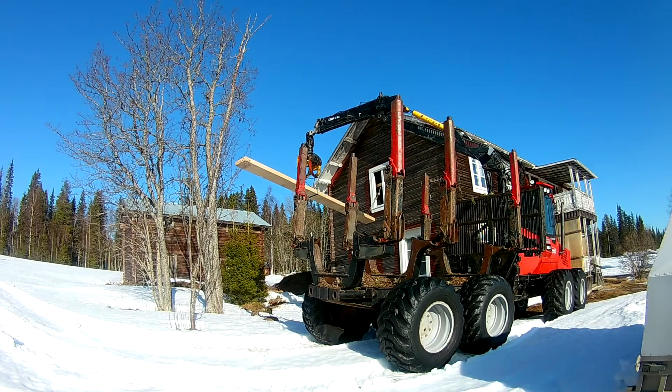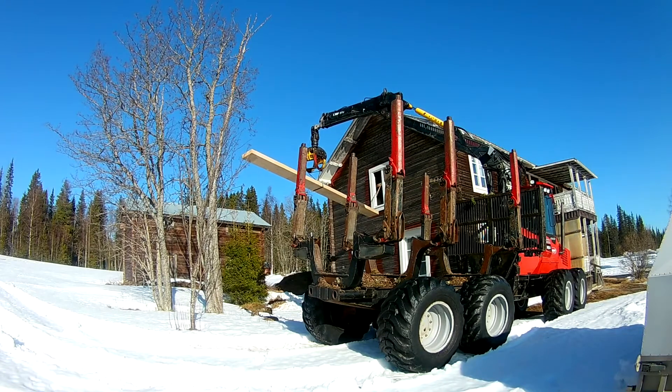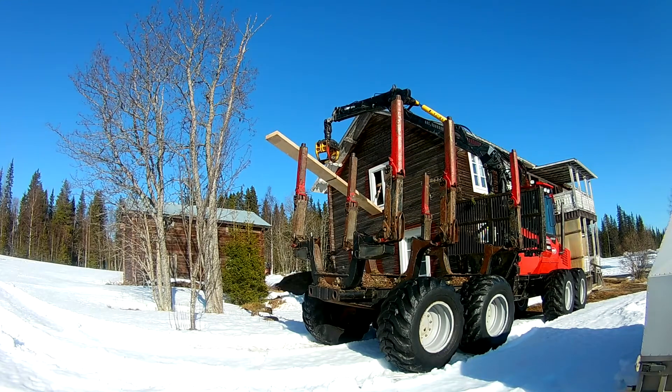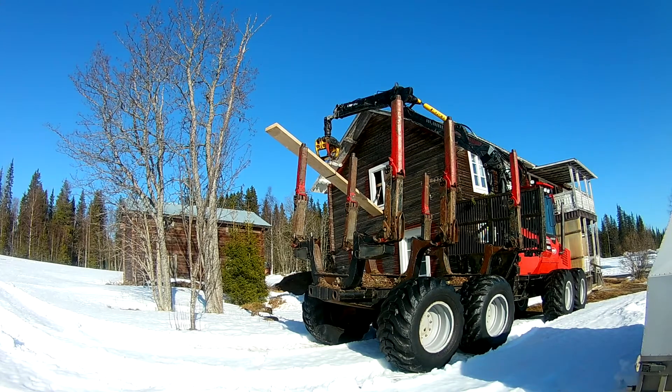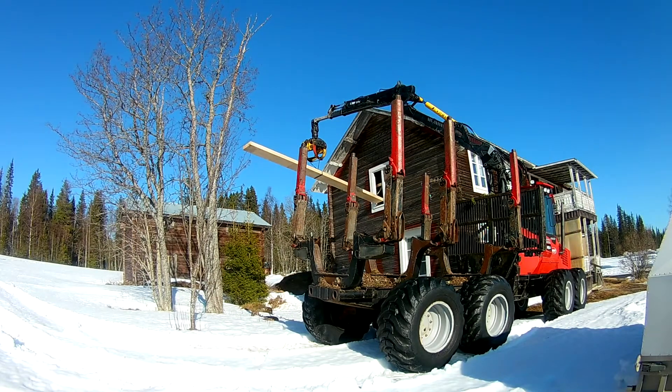Here it's helping out around the house — we're feeding in a glulam beam to do some reinforcements in the house. I turned the crane down to super slow speed, which was actually a bit too slow. The computer had run out of power by this time so I had no easy options to change anything, but we still did the job. I'm leaving you with another three or four minutes of us very slowly getting this beam into the house. As we got it up there we used chain locks and kept pulling it further in until it was in location.